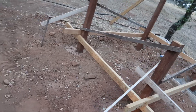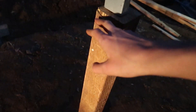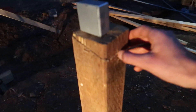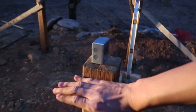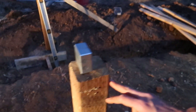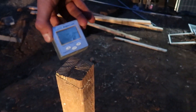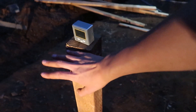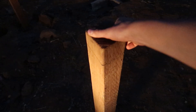I got the angle cut out - we're doing 18 degrees of slope. My dad already cut it. I got the laser level to make it flat, marked the corners, and got a piece of 2x4 on an angle cube. We put the 2x4 slanted and marked it. Now I need to measure the other side so I can cut it and that'll be it for today.